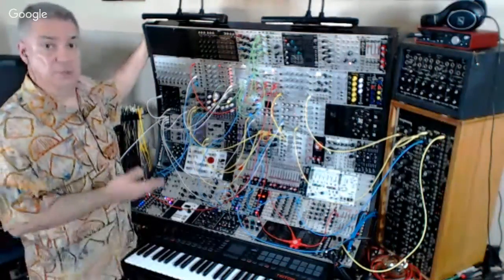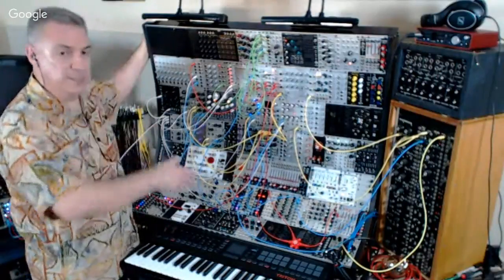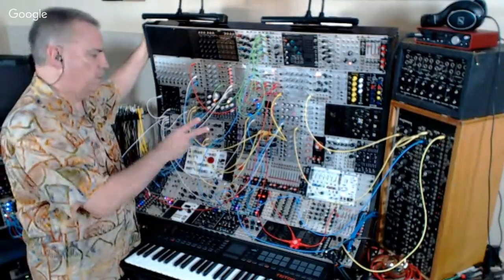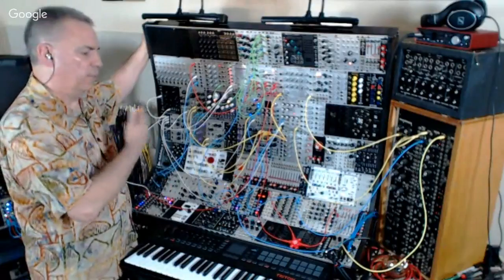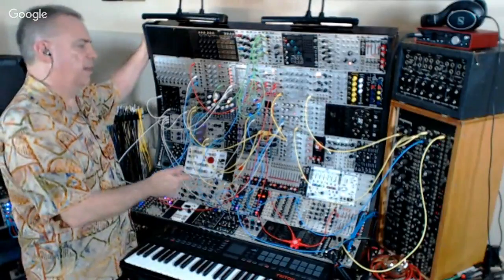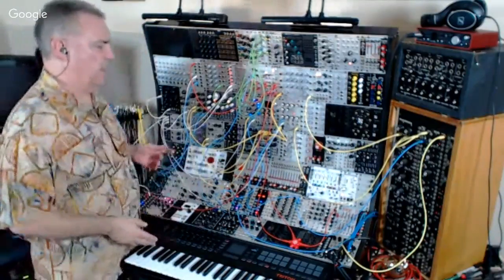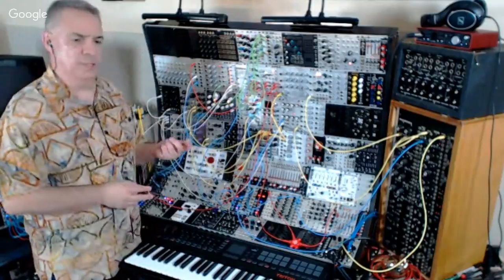Yeah, Data for me. Both Data and O-tool have a lot of additional features. I think the O-tool even has a Euclidean sequencer in it now. And there's all these voltage sources and things like that out of the Data. I use the scope display 99% of the time. And for me, it's having the 4 traces, because a lot of the time you just need 2 traces, input to output, to see what's going on. But there's been a lot of cases where I've needed to see 3 or 4, particularly when I've got complex envelopes or random voltages going on, or I have multiple waveforms I'm mixing together. I've needed at least 3, and that's what trips it over for me for the Data. Again, the idea of the system is not to say, sorry, you can't do that. I've been building my system based on, I want to do whatever I can imagine. The Data is one of those things that just doesn't restrict me.